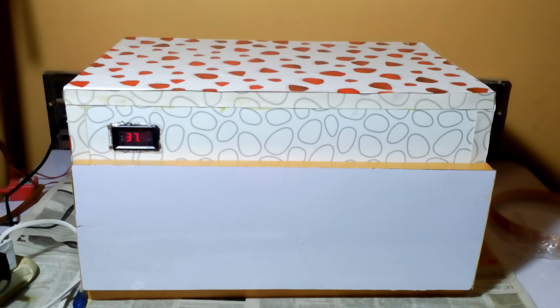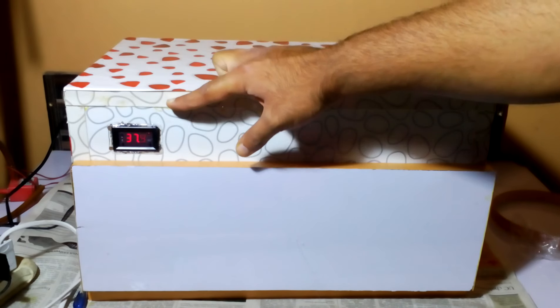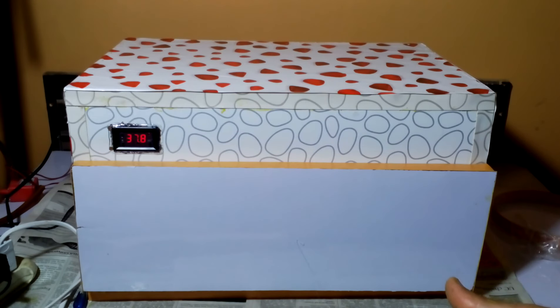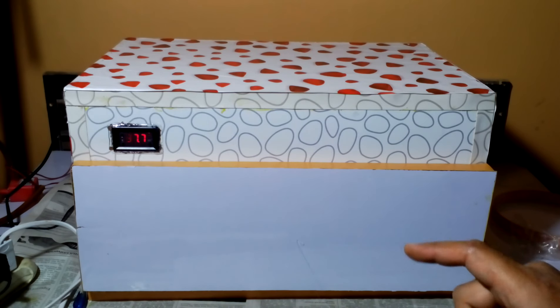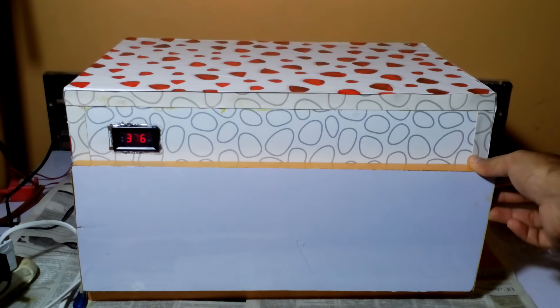The depth is 12 inches. I have used the W1218 temperature sensor — it is going to trip on 38°C and will trip off at 37.5°C, so it's a 0.5 degree difference for this controller.